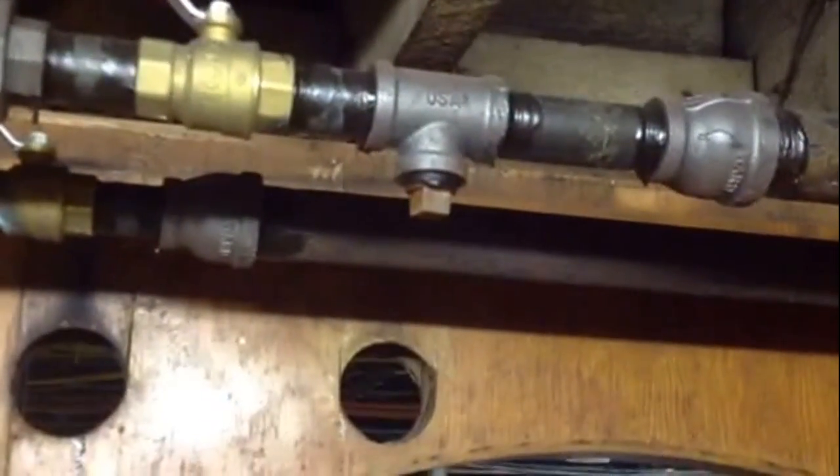As you can see here we have one expansion tank. All the big piping was ripped out — we used to have large piping there. We reduced it down to smaller piping, mainly because of the boiler and a lot of valves. Over here, more valves. We attached all of it to the old piping. What we do in a system like this is add valves in places where you can drain different parts of the system.